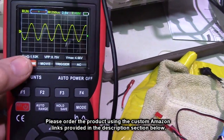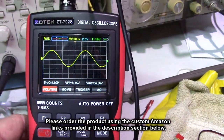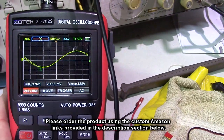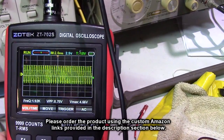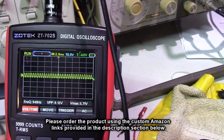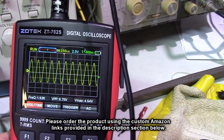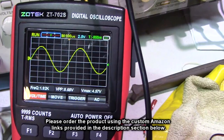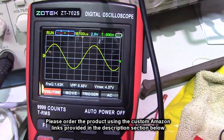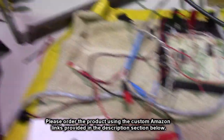Really cool — you could go to voltage and time by hitting the F1 button, and then you could change the time scale on there to see that wave perfectly. You can also change the amplitude of it, which is exactly what you want if you're doing testing. You can hone in on a given signal — it could be totally digital or analog. If you're doing digital electronics or analog, it'll work fine for either one.